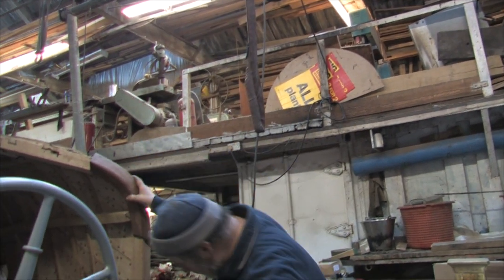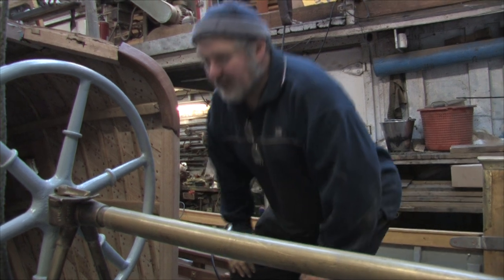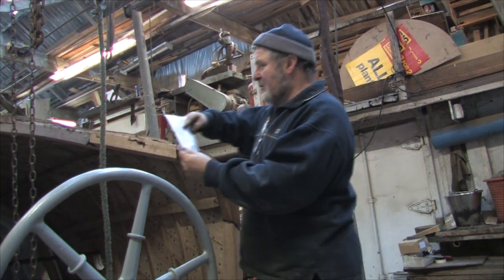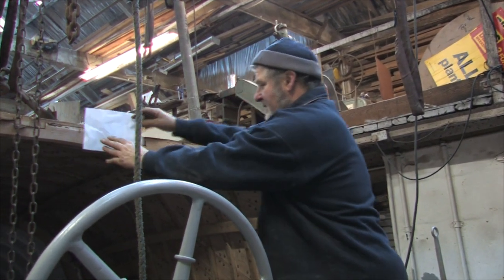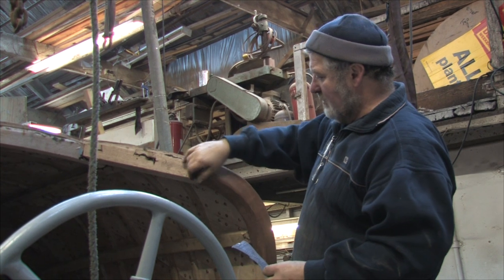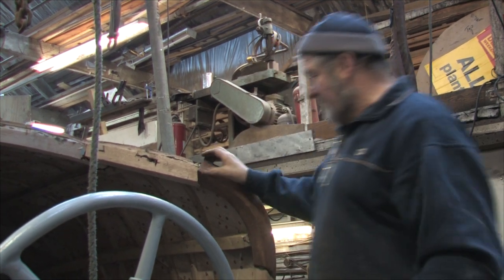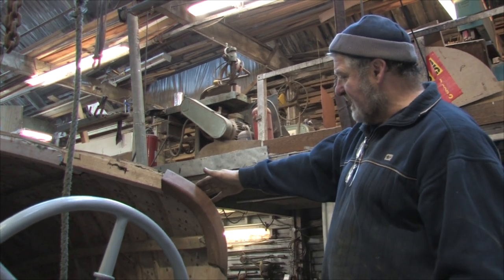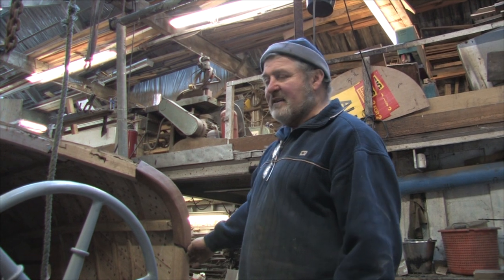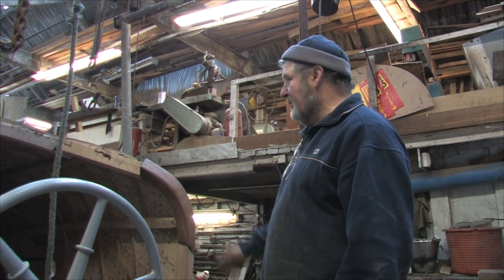Now up here, you see we've got the end sections fitted to dress the end of the cabin off. They're not completely finished yet because our next job is a lump of oak, which goes on here to take the windscreen, comes across there like that, and then another piece across there, and it's shaped to come down and match into this here. So we've left quite a bit of thickness on there until we get the finish, so that corner will be dressed down a bit more. But that's like a double curve on there, and we'll have to get a piece of timber glued up to get that. And to get that shape, we're having a double sweep. You have to start with a 6x6. It's very much like the end of a staircase on the old-fashioned banister turns. So it's a big lump of wood to get a little piece out. But that's it there.